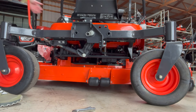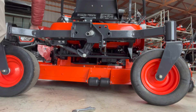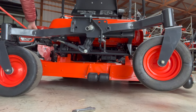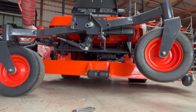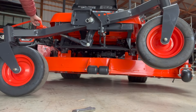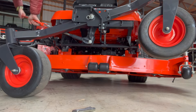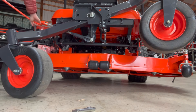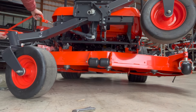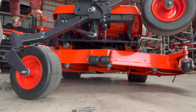This is the handle — we throw it out here off to the side and I'm just going to start cranking it up. This is a great feature if you don't have a chain hoist or another tractor with a loader where you can just pick the front end up. It's also very, very safe. Once we get this up, we can use those pins that we took out to lock that front axle back up so it can't come back down, keeping the machine up where it needs to be while we're under it.